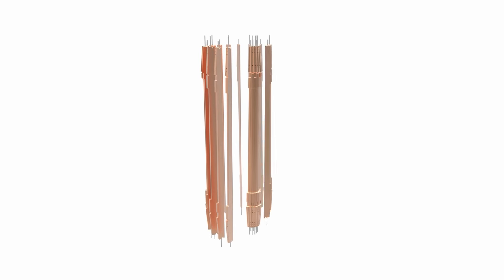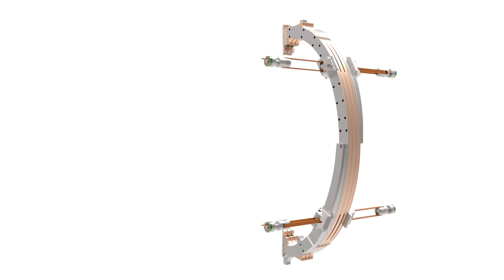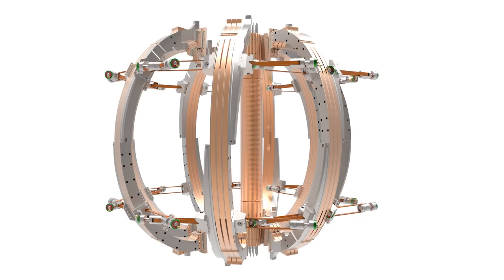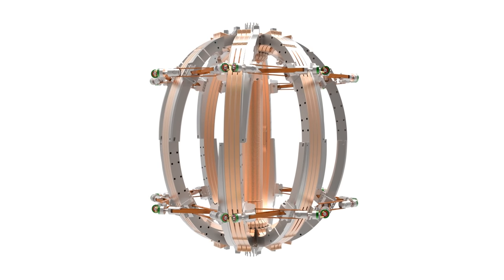They come together as follows. Inside the solenoid, there are 24 wedges that fit together. These form part of the big toroidal field magnets that loop around the donut vessel. There are eight sets of three limbs that are bolted together and electrically insulated, that connect to the wedges in the center column and form the toroidal field coils. Grouping the limbs together makes it easier to access the plasma through the gaps. The orange pieces here are strengthening.